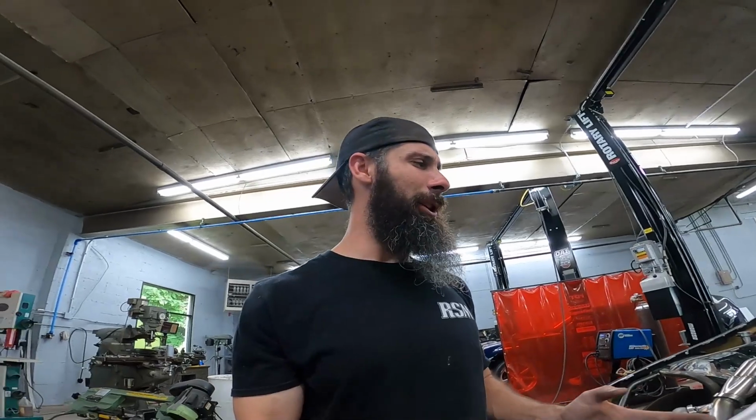With the headers, I've had pretty good luck. When I weld them together, I've got a 2x4 aluminum block that's bigger than the header flange. I usually have it C-clamped to that block whenever I'm welding it together, and it does really good. But obviously you can't clamp it to a block whenever you're welding inside the primaries, so that's when it gets crooked. So usually after I've done that, I'll put it back on that block and heat it up really hot, and I will clamp it down against that cold block, and I will let that thing cool slowly all the way down. And then when I unclamp it, it's usually pretty flat without having to grind half the flange away. Putting them on a belt sander or a surfacing machine or something like that is ideal if you have access to that, but we don't have a belt sander that's big enough for the flanges, so that's what I usually do, and I've had pretty good success with that.